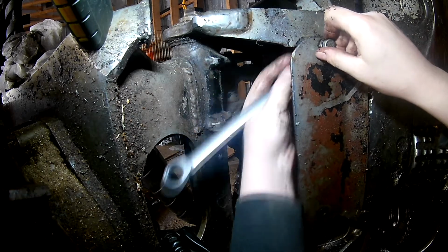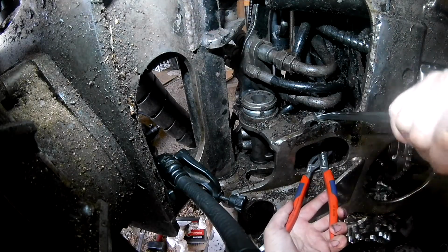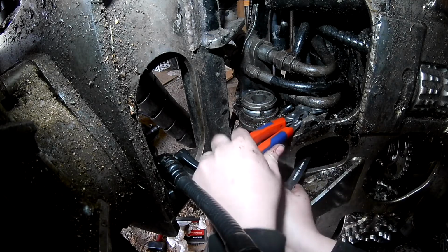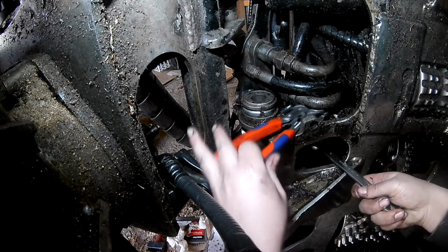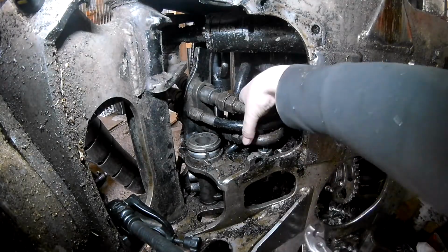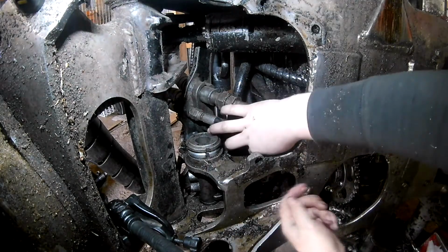Had added a grease fitting to a place here where there's supposed to be a hose, and you can grease it from that battery of grease fittings that's on the harvester head. Turned out it was really hard to access that grease fitting, and you had to have the harvester head upright where the rest of everything pretty much can be greased with it laying down. So decided to address that and try to add a connection to be able to grease it from the quick connection, and the grease fitting was removed, the axle tapped out.